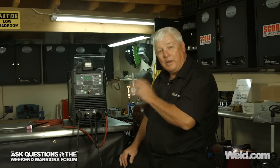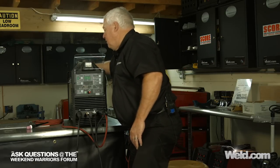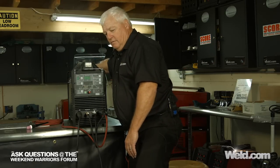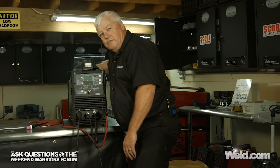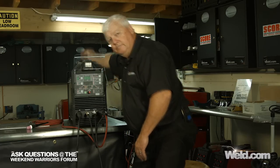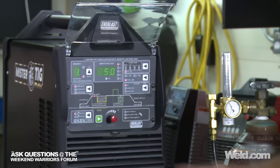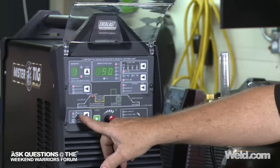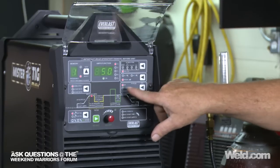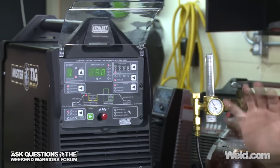If I shut the machine off and turn it back on, it's going to go to my program number 1. So let's try it. Give it a couple, 3, 4, 5 seconds. Turn it back on. Okay, I'm at program number 1. If you notice, my amperage is still set. I'm still on high frequency TIG, pedal, pulsing off. I'm on DC. Everything is as I left it.